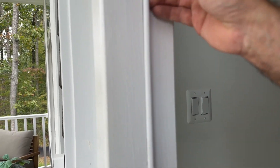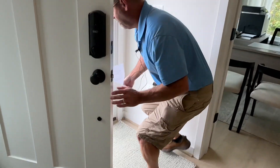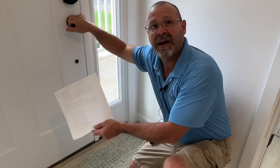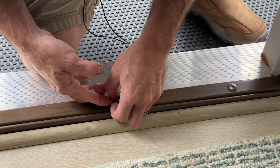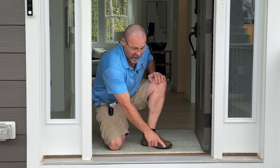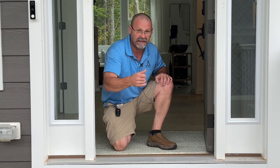Sometimes you do have to trim the weatherstripping with a pair of scissors, but it goes right back into place. The door should have a little bit of drag when you shut it — this paper should drag, and it does. If you had an air gap, it would slide right in and out easily. The threshold here is adjustable. If the paper trick didn't work and it was loose, you would pop these out and adjust these screws a quarter turn at a time. Check your paper trick again to make sure it's rubbing. Once you get that adjusted, pop your clips back in and you're done.